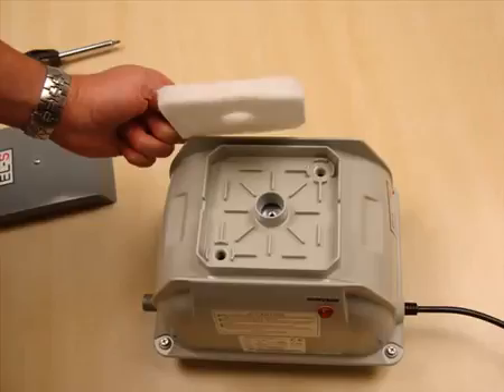This needs to be investigated quickly as foul air will corrode the internal electrics and will wreck your pump. Damage caused by foul air or flooding isn't covered by the warranties, so it's best to fix the cause of the problem as fast as you can.